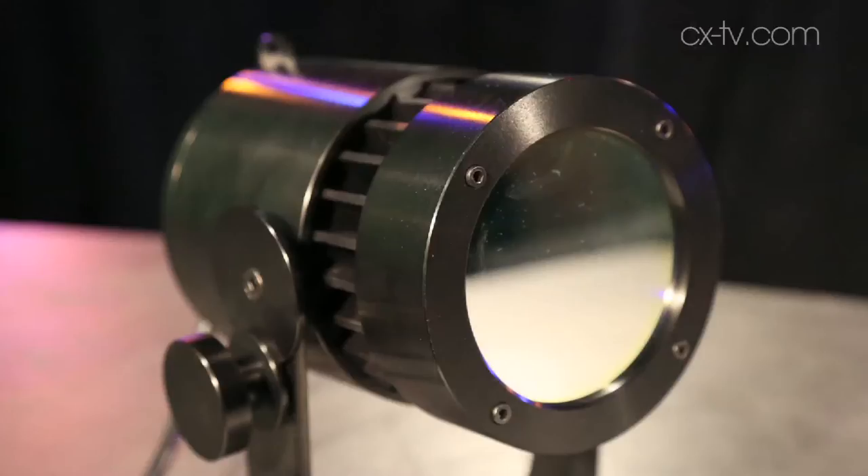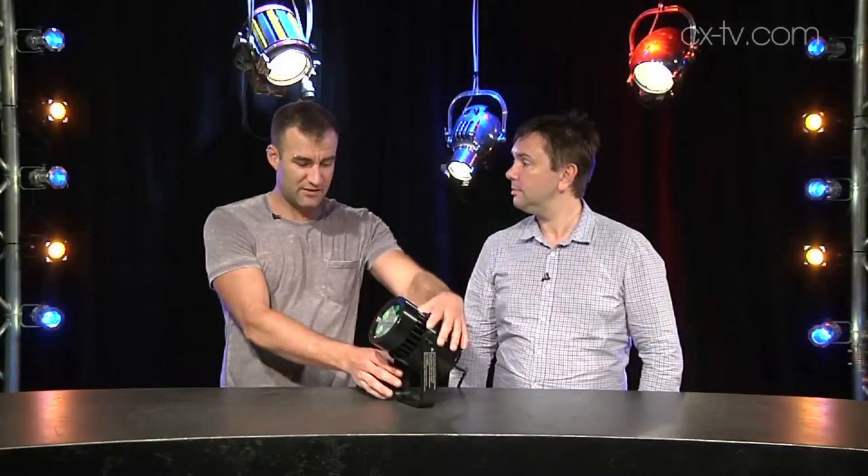set elements, or anything theatrical really. Basically, it's not really the sort of fixture you use to light up people, and especially not at short distances, because at 365 nanometers it's not a visible wavelength — it's just sort of outside that range. So it's not really obvious how much energy is coming out of the front of this thing, but it's eight and a half watts worth of LED, which is not insignificant. It's also IP65 rated, because apparently one of the other applications for UV light is on outdoor stuff like theme parks, bringing anything to life that's got that theatrical, spooky glow-in-the-dark vibe going on.